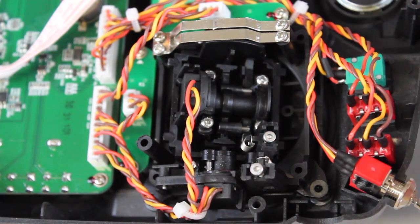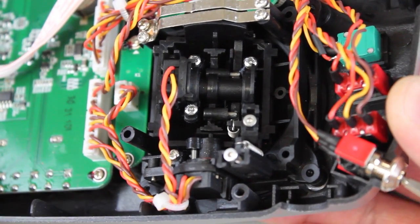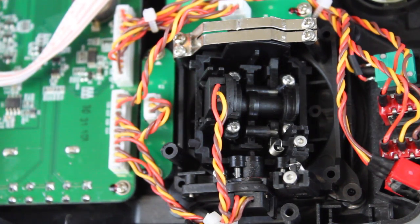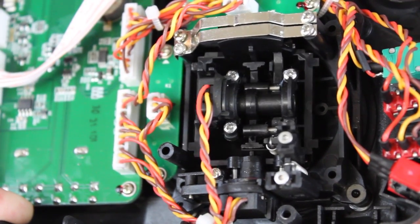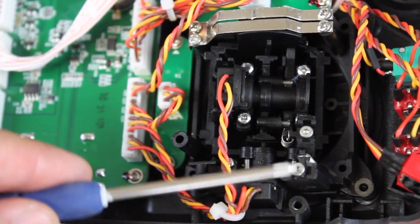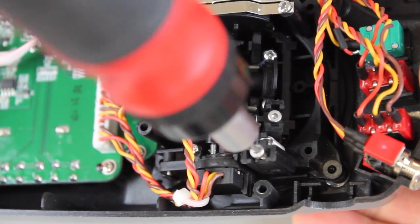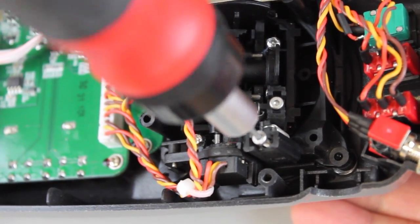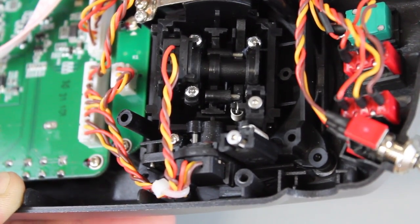We're looking at the inside of the front side of the transmitter. This is the throttle and rudder stick. Watch as I push down — all the way down — then let off, falling back into that default position. We want to get it so that it's all the way down. Inside this stick assembly there are a lot of Phillips head screws and a couple of hex screws. Through a little trial and error, I found this spring right here — if I move the rudder, you can see it expand and contract. On the y-axis, the up and down, we want to adjust the spring, which is associated with this hex screw. I'm using a 1.5 millimeter bit. I'll loosen this screw while pushing down on the throttle, getting it just to the point where it no longer jumps out of place. And right there — we're zeroed out. My throttle's all the way down; I'll go all the way up, then back down. Now it's staying in place. So now I'll go ahead and put this back together.